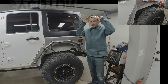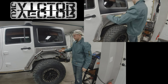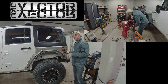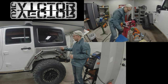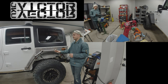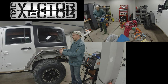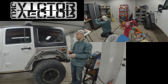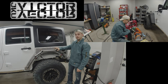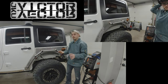Here's the first look at the concept — you can finally get a visualization of my intent with the fender flares. I still have a few things to finish up before welding, but one thing to mention: when making each of the connecting lengths between posts, I cut and notched the exact same tubes to already have matching pieces for the passenger side. Since I have all the post locations marked and know the exact rotation due to the 10 degree taper, these connecting tubes should come very close to matching.